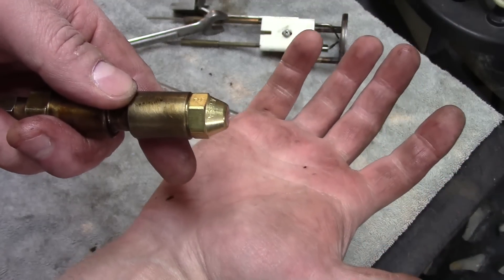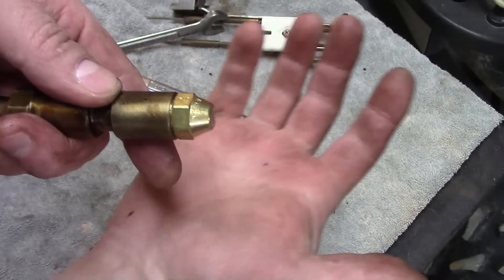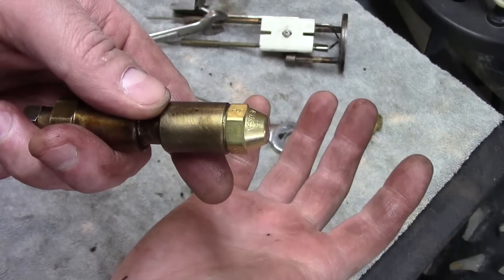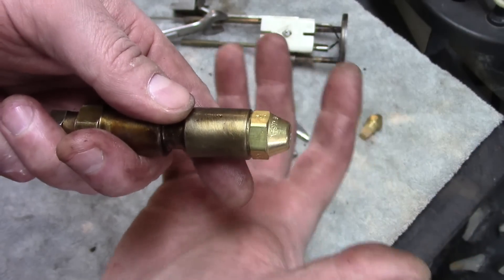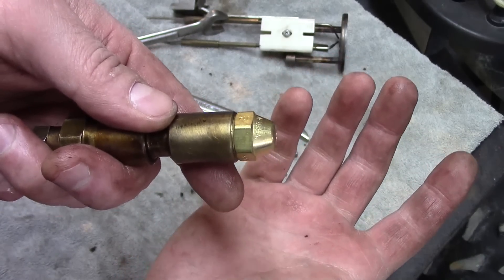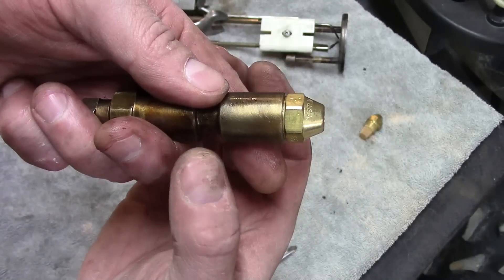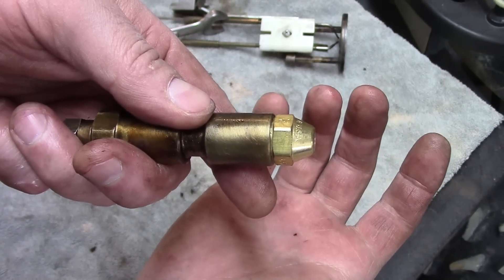You've got a burn chamber — we'll look at that in the next video where we clean the boiler. The idea is the spray pattern should essentially fill that burn chamber to the appropriate amount so that you can have the most efficient burn possible. We're not doing any diagnostics where we're actually measuring the output of the stack or anything, but just to give you an idea of how all this works together. There's also an air gate, kind of like carburation — if you're going to have fuel, you've got to have air. So there's also a mixture of air that's involved.